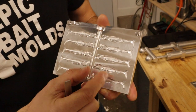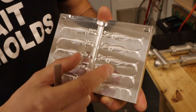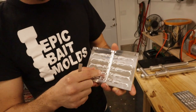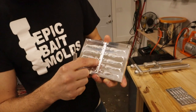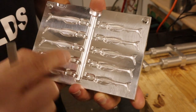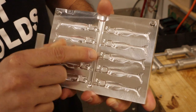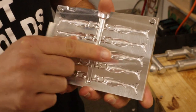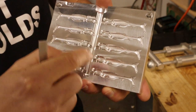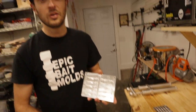If you shoot really hot it's going to harden and shrink more, so you want to shoot a little cooler so there's not as much shrinkage in the bait. Also if you shoot really fast and really hot you're going to get more of a swirl in this chamber, so you want to shoot a little cooler and a little slower so that one color stays on top and the other stays on the bottom — they kind of just glide together into that bait cavity. Otherwise it'll do more of a mix, but maybe we'll do that and show you guys what the results are.